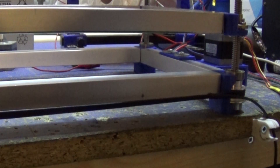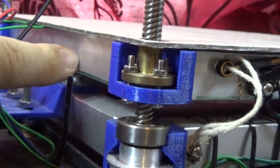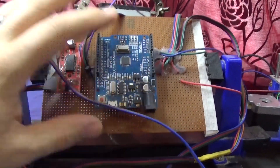There are a few things I need to do to start off with. First, I've got to attach the belt — at the moment I've just got them overlapping, tied together with a piece of wire. I'll show you a way of connecting it quite sturdily. Then I need to drill out a bit of the metal on the underside so the bed can go down a little further. Once that's done, I'll need to readjust the little finger pointer that presses the limit switch, and then we can start cutting off the excess bits of PCB and coming up with a case — either laser-cut or 3D printed.